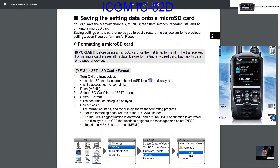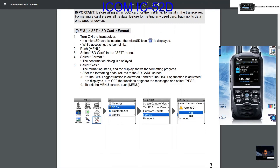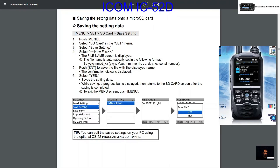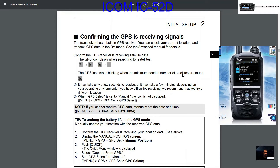Saving data to the SD card: turn on, press menu, select SD card, select format — a confirmation dialog is displayed, click yes and formatting starts. For saving settings: go to initial setup menu, SD card set menu, save setting, new file. You get a file name prompt, then click save.